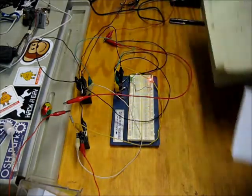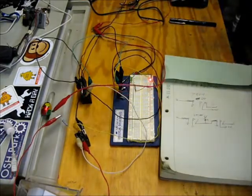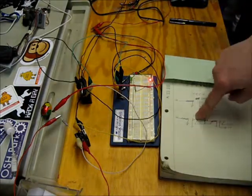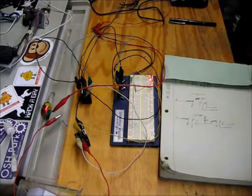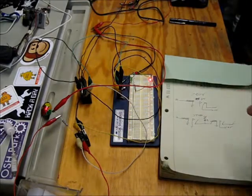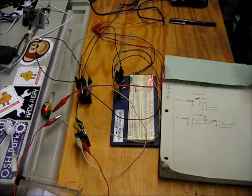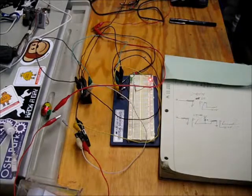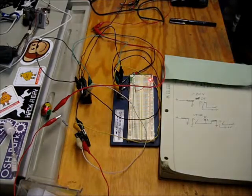What's going on here is this first coil, so two single pole, single throw relays. So single pole is how many switches the relays have. Common is single and double, but you also see quad ones, and every once in a great while you see some bigger. It's just how many switches one coil controls.